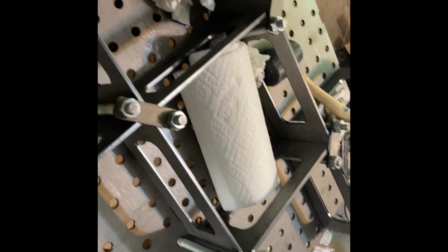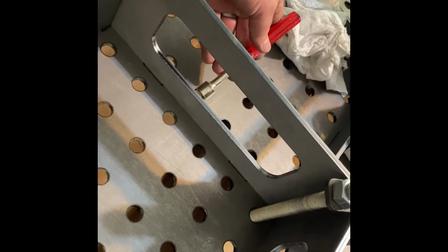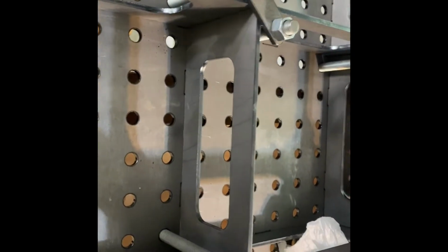So I got all these things cranked down, and how you check to see if it's flat enough or if there's no obstructions is, let's pretend this is a flashlight. You shine it on that side, you look for this side to see if any light's coming through, and this thing's sucked down pretty tight. I don't think that there is anything getting through there.